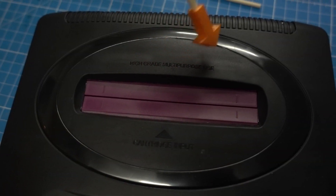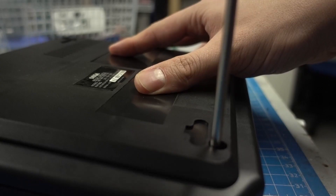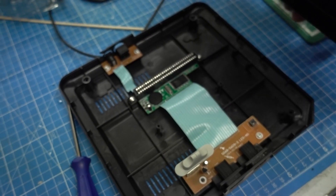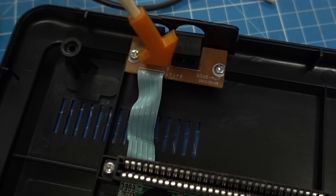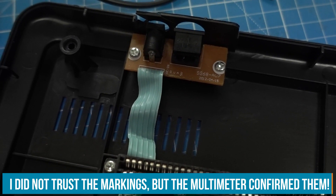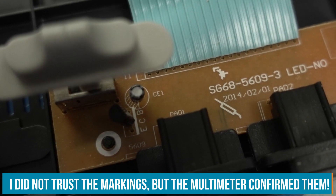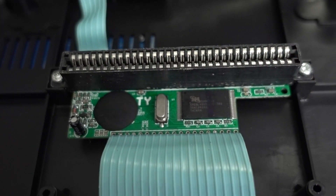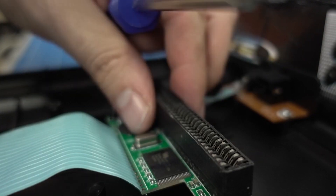On first look after opening it, it's obvious why it's so light — there's barely anything in there. It works the same as Nintendo on a chip; it's just a Mega Drive on a chip, a dedicated ASIC that was glob-topped to the PCB. It's conveniently labeled for the audio, video and power inputs, so we can assume that pinout. The rest is basically trial and error to find the correct pinout, so I spent a few hours figuring out how this thing works, how everything is connected, and making a schematic.